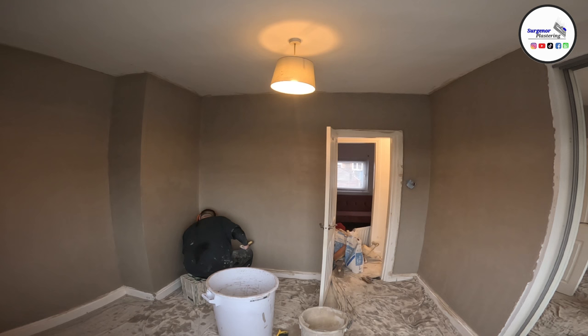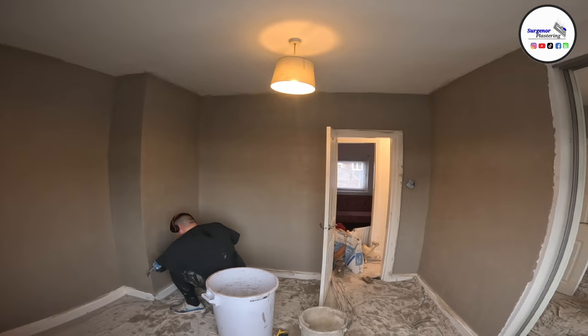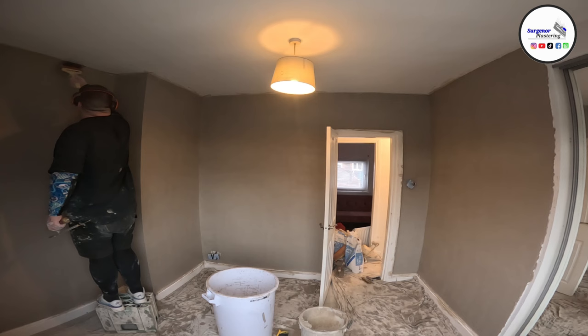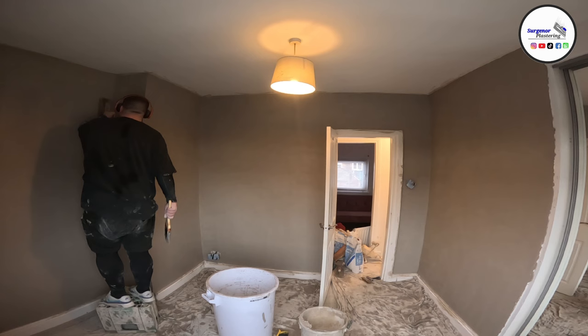And you can agitate the surface of the plaster with them, and then you use your cutting trowel with lots of pressure and a decent angle, and you cut a lot of the plaster off the wall. You should be going back to the bucket every time you need to dip your water brush. You should be having to clean the excess plaster off your trowel. A lot of guys say that they shouldn't be taking that much plaster off the wall, but because walls are so uneven in old properties, I like putting a slightly thicker coat on that allows me to cut a good bit off to give that nice smooth finish.